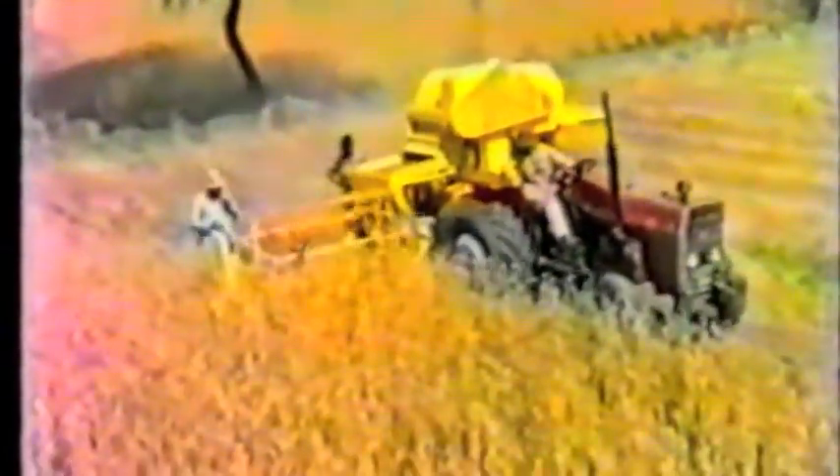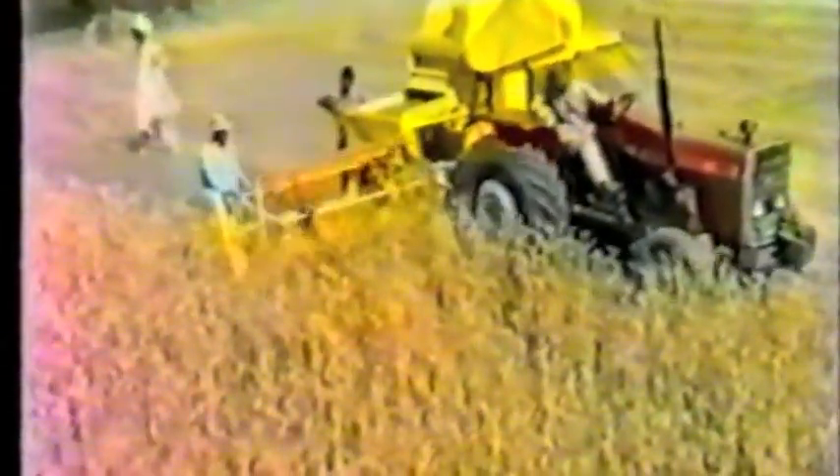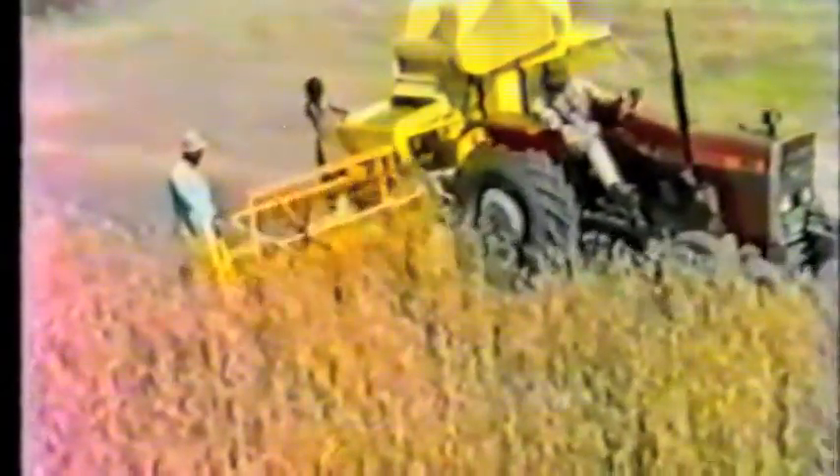To make the harvester ready for work, the cutting table is rotated 180 degrees into its working position, and the bagging platforms and straw bagging hood are lowered. There are twin bagging attachments for both grain and straw, so bags can be changed on the move. Here, the harvester is working in a light crop of wheat. It is working quite satisfactorily — notice there is no build-up in front of the auger, and the cleaner screen is hardly loaded.